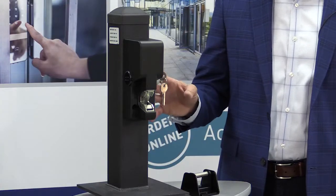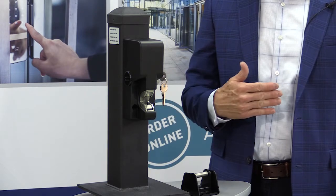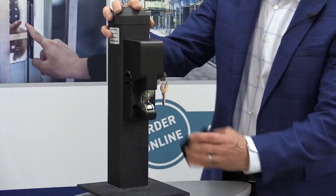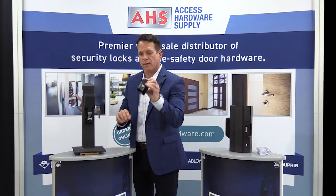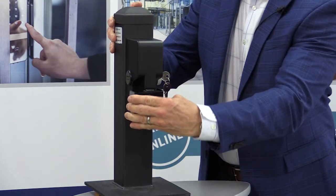Bill: Mike, you have another product there — it looks familiar. Mike: This is the Securitron GL1 gate lock, ideal for gate and fence applications — it's a stalwart of our line for that industry. It's ideal for swinging or rolling gates, and we have all the bracketry to mount it on various types of gates — square, round, any type. This lock will accommodate up to 2,000 pounds of holding force at 100 pounds of preload, meaning if there's a lot of tension on it, it'll still release. It's an easy quick-connect or quick-release device with a self-aligning armature.